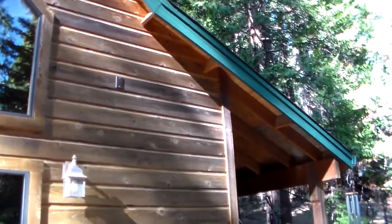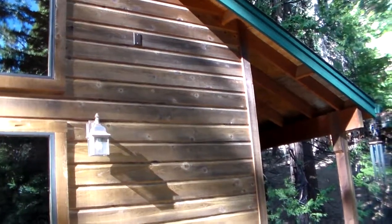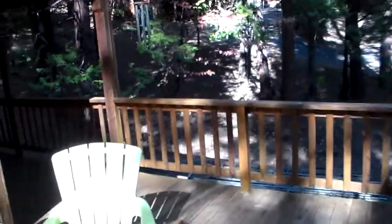I do a lot of high-end stain homes, so I prefer to take them and make them a little more modern. We've been taking a lot of trim to a carbon color — almost a black — and it looks really nice. But I'll paint whatever you want. For trim and stain, I think we should match it more into a reddish brown instead of the tannish color it is now. A job like this takes us a week, five to seven days, depending on weather. If it's December, it might take two weeks because our days are cut — we can only stain from about nine to two, the warmest period of the day, because I don't like to mess with the longevity of my products.